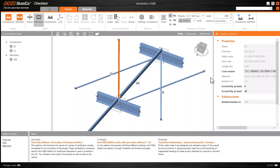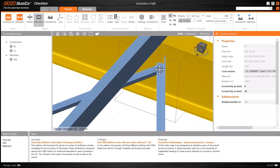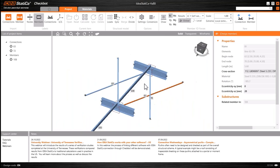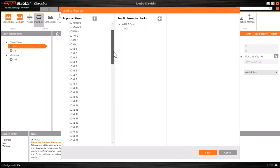For some members we have to reintroduce the eccentricities so that we can offset them — particularly these angle bracing members — so that we can offset them up and down, ready for almost like back-to-back leg connections, so that they each transfer over the top or underneath the other one. We've got control of eccentricities and we're constantly looking at ways to improve the functionality here within Checkbot and member configurations.